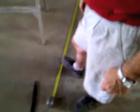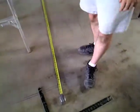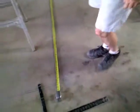I actually like that you're angling the wall more. So you want me to make this 3 pieces of sheetrock here? If possible, yeah. I can do it now. Okay. What do you have to change? Nothing, just shift the door over a little bit. Okay. I'll have to move it 1.25 inches. Okay. That's going to change this angle even more, right. That doesn't hurt anything. No, it actually does it better. Again, as long as we get those different boards.